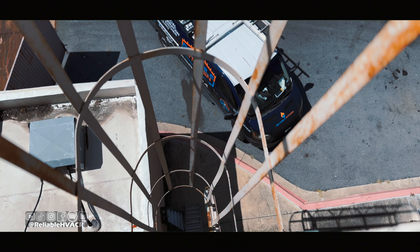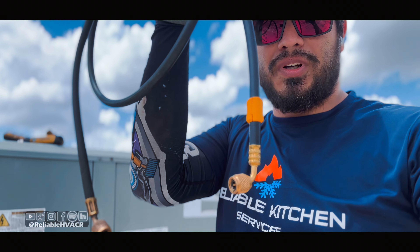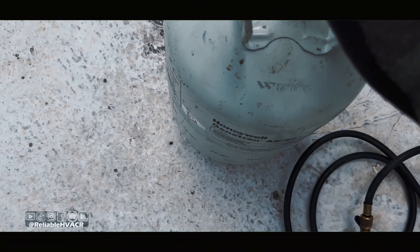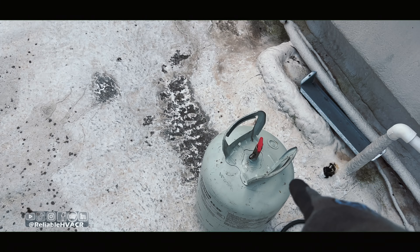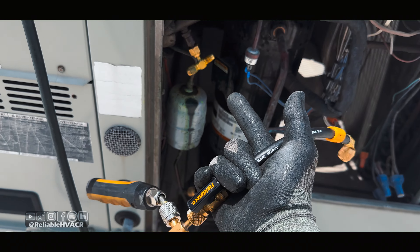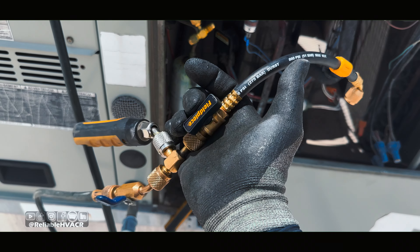Not my favorite location. This got approved way too late — I got my tools, I have my probes in there. Let me show you the setup I have for charging with probes. I have a 410A tank here that I'm trying to get rid of — it doesn't have a whole lot and I told her I'd top it off. I completely forgot to bring the dye kit so I have to clean this out with some nitrogen and paper towels — I've done it before, it's not a big deal.